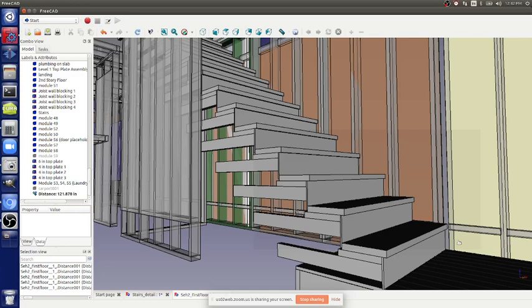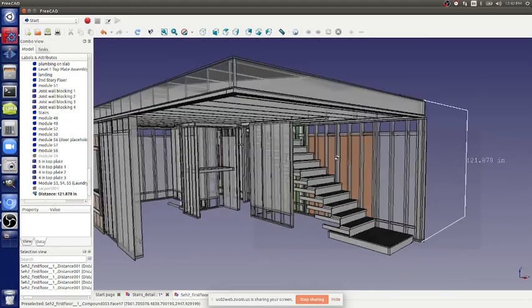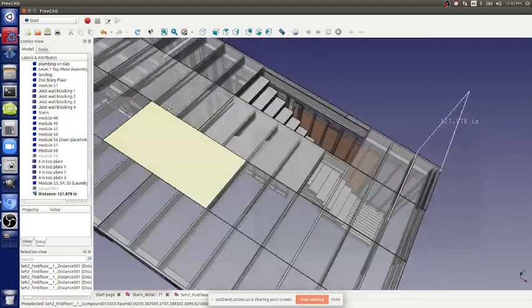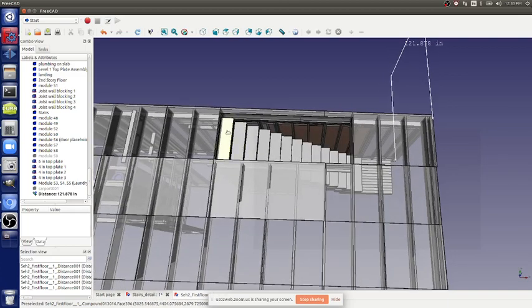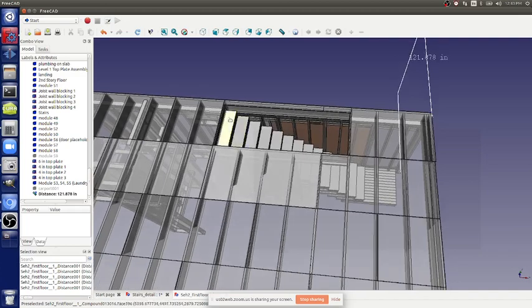Yeah, but that's pretty transparent, because if you take the height and divide by 14, you've got to be at the right place. So, yeah, we should verify. Right. Divided by 14, no, right, exactly. Well, divided by 15, because the last step is where it gets confusing, when you have to add the last one. If you take the full height, the last step counts, so it's 15.